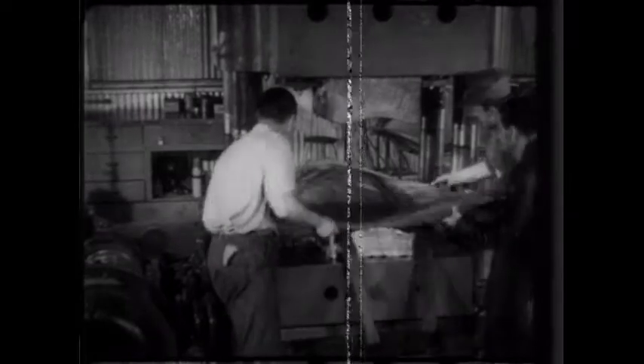An interesting variation of rubber forming on the oil hydraulic press is being tried experimentally in one plant. This method is of particular interest because an ordinary hydraulic press is used with no modification whatever. The novelty lies in the fact that instead of a single die only with the rubber acting as the punch, mating metal dies are used with a sheet of rubber simply laid over the punch. The real ingenuity of the method is in the fact that the punch and die do not exactly fit each other, causing the rubber to flow in a controlled manner into the cavity left when the two are brought together.